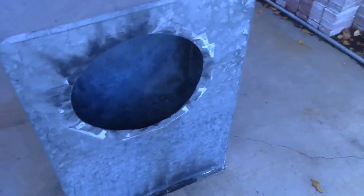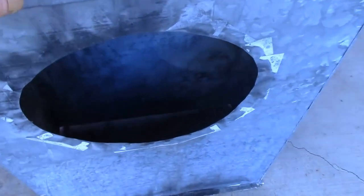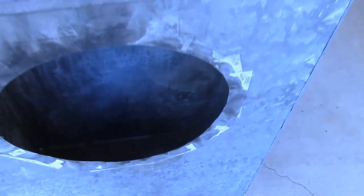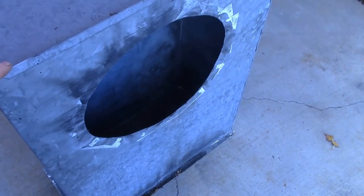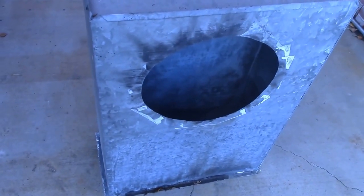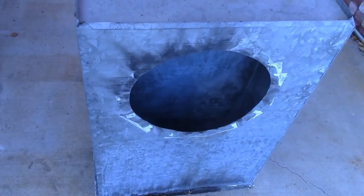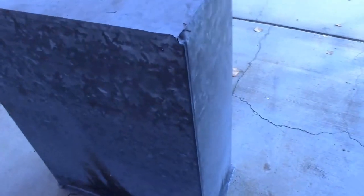This used to be up in the attic with a 12 by 24 inch grill down below, open all year round. You can imagine how effective a heat sink this was — in the winter it would get just as cold as the attic, and cold air falls, so this was a huge source of cold air. I had never bothered to look up in the attic at this; I assumed it was insulated, but it had not a single bit of insulation.